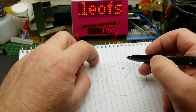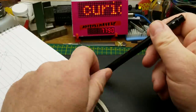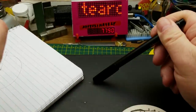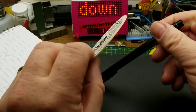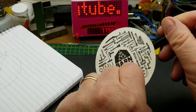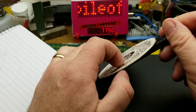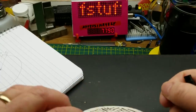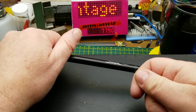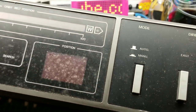From any given place on earth you could see a good number of satellites, but your dish could only point at one at a time. So to move the dish around and keep it pointing in the correct direction, you'd have a mount on the back of the dish at an angle that points 90 degrees towards the satellites above the equator. You mount your dish on there, and then to rotate around it pivots on that inclination, and the motor drives it so that it points at the different satellites. You could manually crank it around, but who wants to do that if you're channel surfing? So that's where this device and the motor comes in.